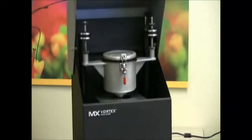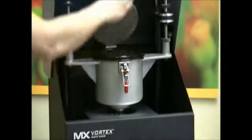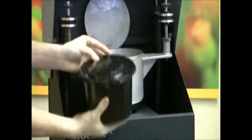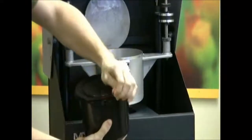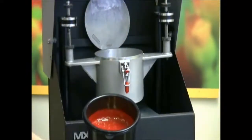Press Start to begin mixing. Let's open the mixer hood and unclamp our mixing pot cover. Be careful when removing your Greenline, as the contents will have increased in temperature. It's typical for ink temperatures to exceed 90 degrees Fahrenheit after 5 minutes of mixing.